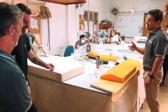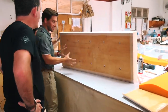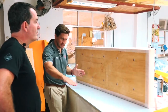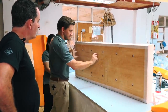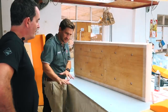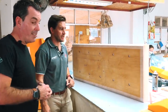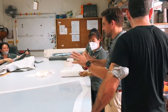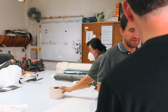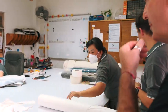We've got a locator here — it'll have a timber surround that gets screwed on. On our furniture molding, we have a recess where you can access the batteries and things, and this timber piece fits into that recess to locate the seat. We had those in the 1260 and they're really useful. All cushions get cut per template and then fitted to the boat. We have to factor in the temperature here in this hot climate and anticipate some shrinkage so we don't get the fit too tight.